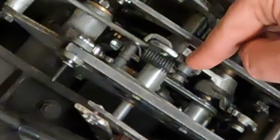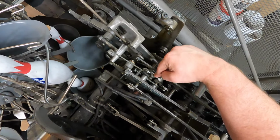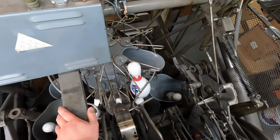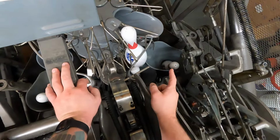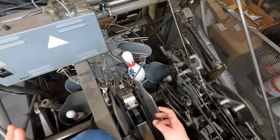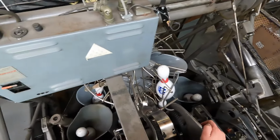Next thing would be right here in the detector. You have your selector and your cam follower, and there is no gap between the selector and the cam follower. So that's another thing. Now, the next thing would be, as long as your deck hook is adjusted correctly, your deck hook. There is a gap between the pin and the deck hook now. That is the way to tell if your machine is on first ball.